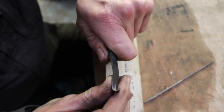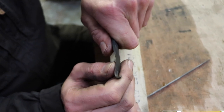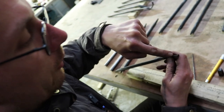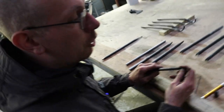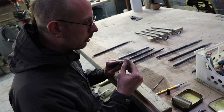Another thing, while you're turning and you want to figure out, oh, is my tool still sharp, is to look at the cutting edge. If you see a reflection on your cutting edge, then it's basically saying, oh, I'm dull, I need sharpening. Yeah, but that feels good.